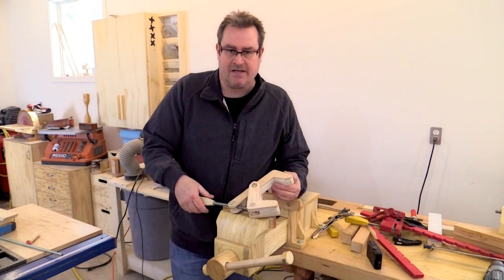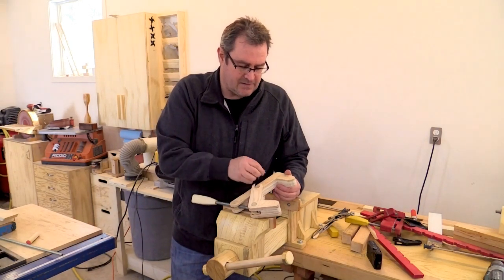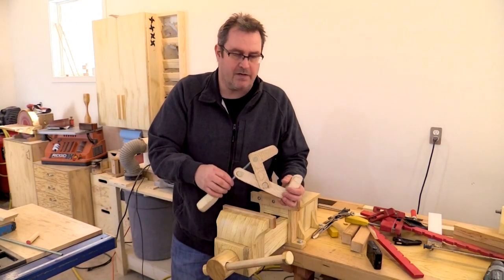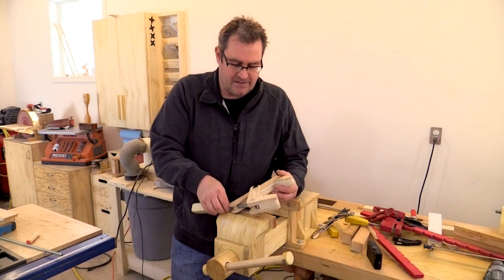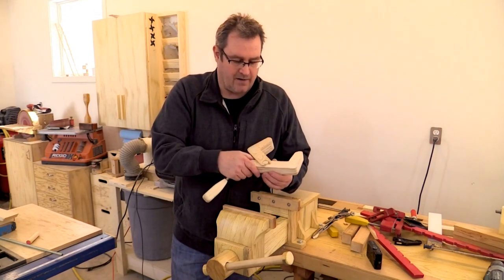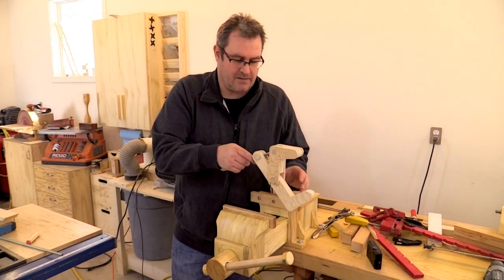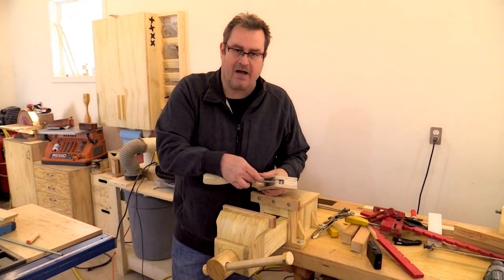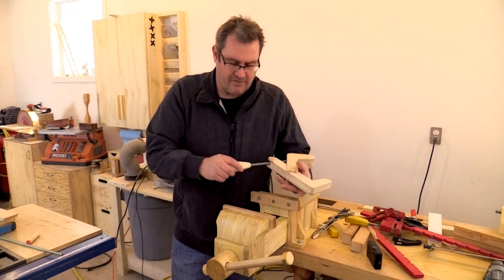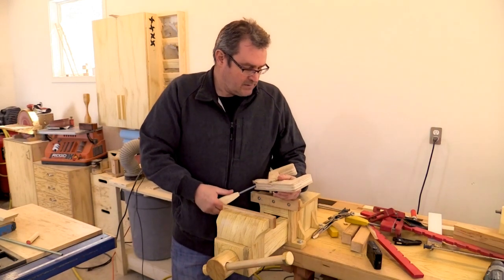What I will do is take this data I learned and come up with a stronger one — one that uses half-inch plywood in the critical places, which would be right here on this short jaw. That is definitely not strong enough; that's where it failed first, and this is where it failed second. I can 100% rely on the threading on this. Everything else appears to be really good. Even the handle didn't slip while I was turning it with the vise grips.